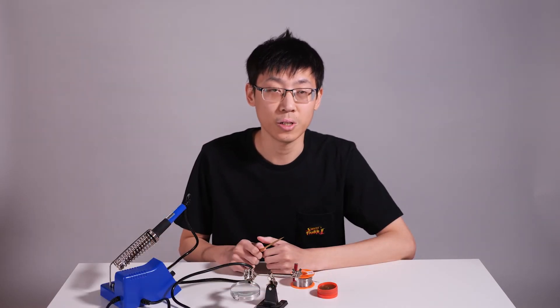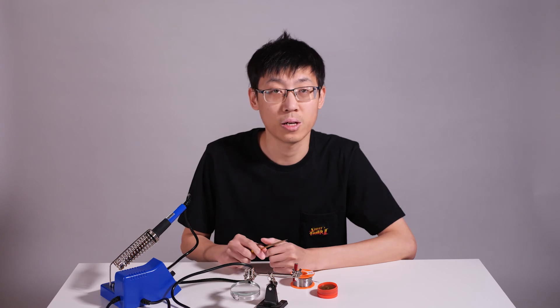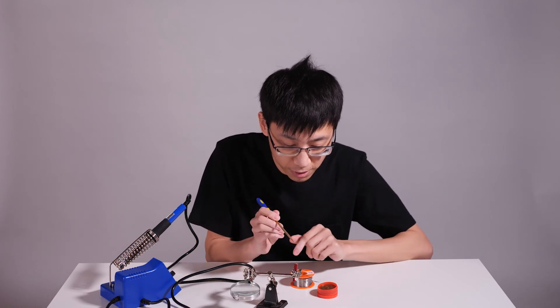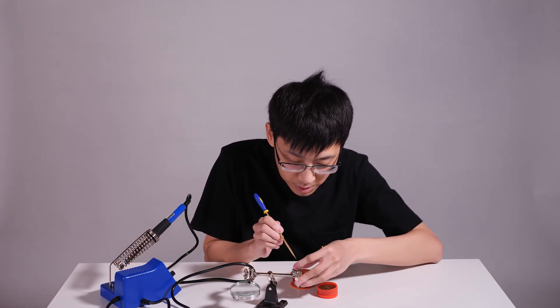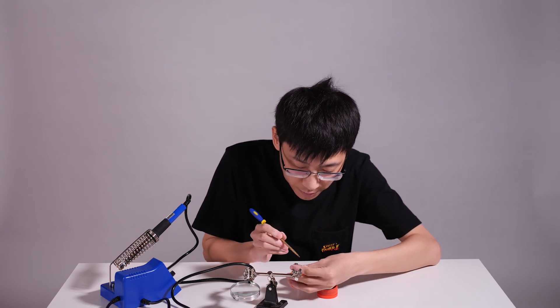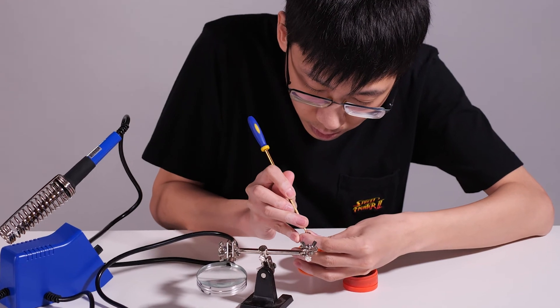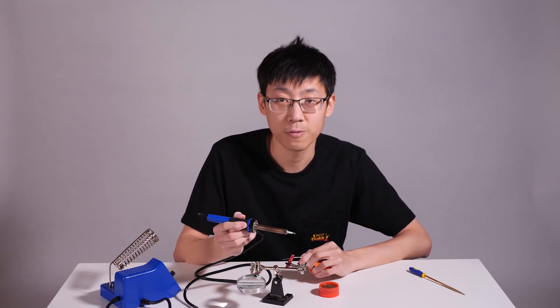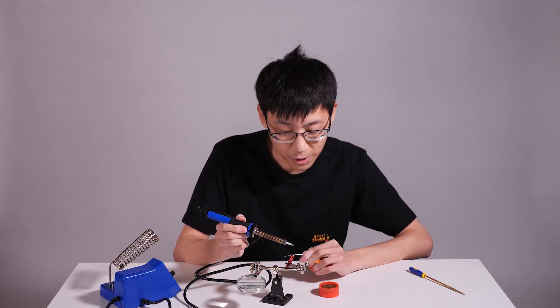The second method would require soldering, but to me that's my preferred method — it makes everything much easier to deal with, and you can give those modified batteries to your friends and they will be super impressed. In order to solder a positive terminal on the battery, you need to make the surface not flat — otherwise solder will not stick. You can do that with a tiny file or a craft knife and just slightly scratch up the surface. Note that the big flat end is positive on these batteries. Do this in a well-ventilated area.